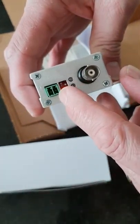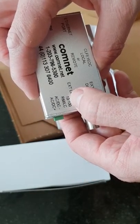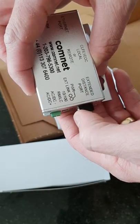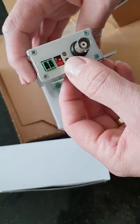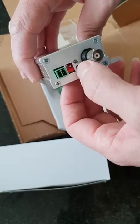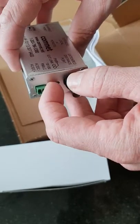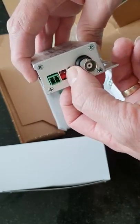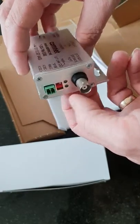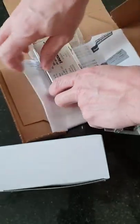DIP switches in here will show which speed you're actually connecting at and which one is the master. I tend to find if you've got a joint anywhere in the coax you'll probably struggle to get it to work at 100 Mbps. If you haven't, then you should be fine using it at 10 or 100.